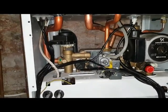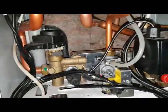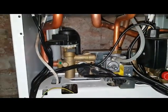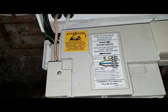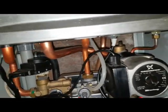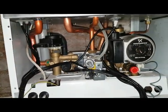In the Baxi family you've got the diverter valve actuator, the pump, gas valve — it's all the same layout — the hot water heat exchanger at the back, and the flow sensor you can see there. They're all the same layout. The PCB is in the same position; the PCBs differ depending on which product it is — whether it's a Baxi, Potterton, or Main. The condensate trap is different on the Main, but it's mainly the same in this particular area.